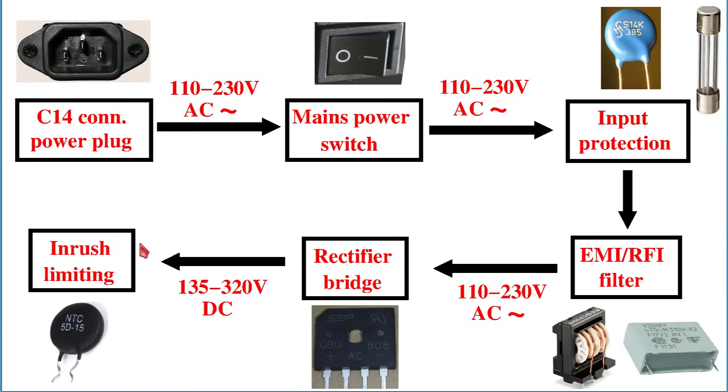Since all these components are exposed to very high voltages which could easily kill a person — indicated here in red — we need some sort of power input to connect the power supply to the power grid. For ATX power supplies most of the time they use a C14 power plug because they are really power hungry. For color TVs or LCD TVs they use a much smaller power plug or most of the time just a cable going directly into the TV. The AC mains voltage is about 110 volts AC in the US and 230 volts AC in Europe — earlier it was 220 volts AC and they may increase it even further.